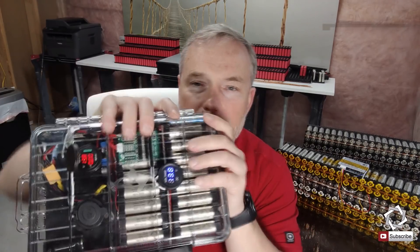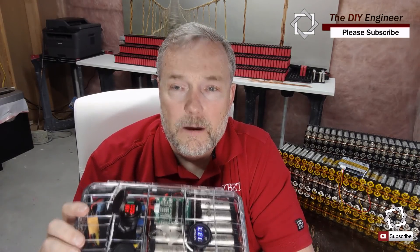This is something to consider, especially on a small kit — it's very helpful to control the amount of voltage in and out and keep the cells balanced. One thing you should look for when finding a BMS is a battery balance feature. A lot of BMSs out there don't state that they're balanced — they just say 'battery management system' and only have a charge and discharge shutoff point. Having that balance feature is important, especially when you get into cell sets like 4S, 6S, 8S, or 13S for power wall stuff — it makes a difference in how those cells stay balanced and functioning.